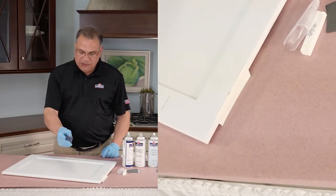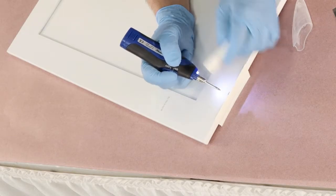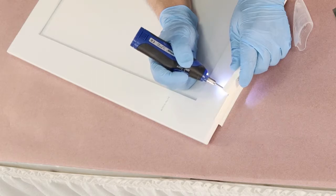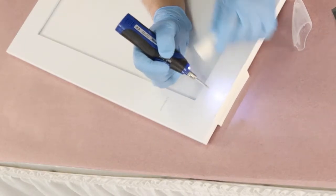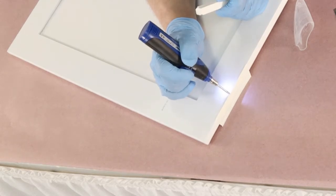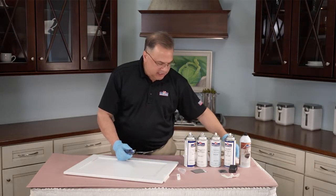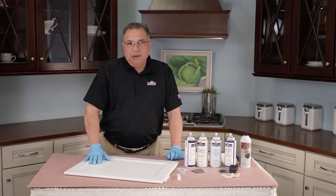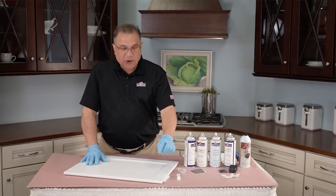What we're going to do is use the heat iron and try to drip the hard fill into the defect. Wipe off the tip — you really want to wipe it off every time and keep it as clean as you can. Now what I need to do is let this cool and remove the tape. Hopefully the hard fill went all the way down to the bottom of my mold or form. If it didn't, I'm going to have to fill that area after I take the tape off.